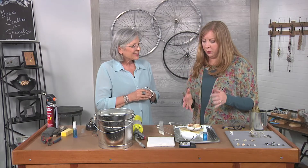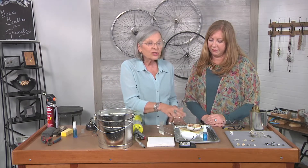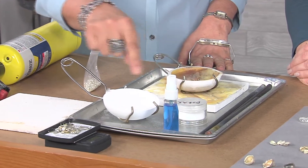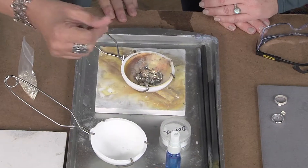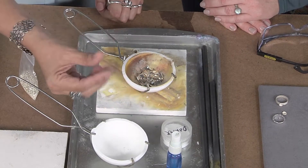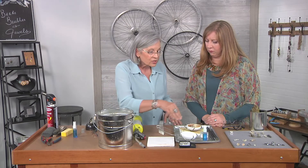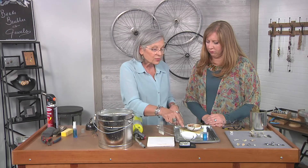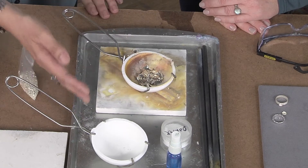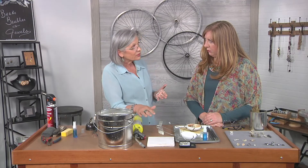So how do you get started with new equipment? You start with the crucible — this is a brand new crucible — and the first thing you want to do is condition it. You do that by adding about a half a teaspoon of borax and spraying some flux. Borax is very fine and powdery so it tends to float in the air; the flux consolidates it and then you torch it. It will take probably three to five minutes until it turns to glass and coats the bottom of your crucible, which keeps your molten silver from sticking to the ceramic. If you're using different types of metal like bronze or gold, you want a dedicated crucible for each type.